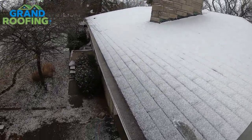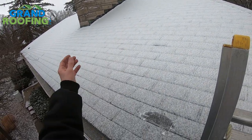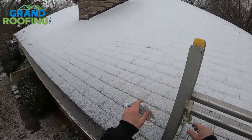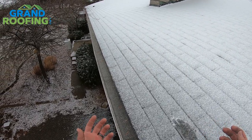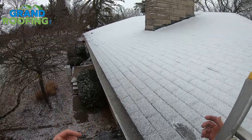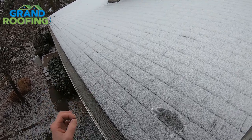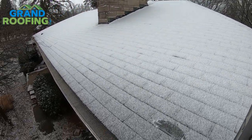Take pictures all around the house. Keep in mind things like the chimney — what kind of condition it's in. This one looks like it's got copper flashing but it's oxidized green, with nasty tar all around it. That's not going to look good — we may redo that. One-by decking tells me it should be pretty solid, but boards could be gapped or splintered. Some areas have strict codes on deck inspections, so keep a line item for redecking in case. If you can get into the house and see the underside, that's another way around that. Labor to tear off one-by is slower — pulling the nails out of the one-bys is tough, so keep that in mind as a factor.